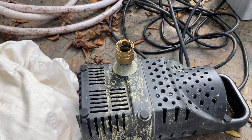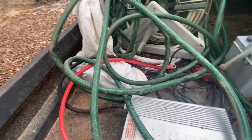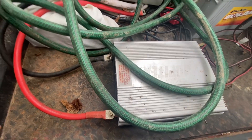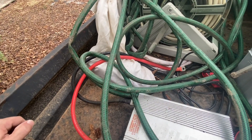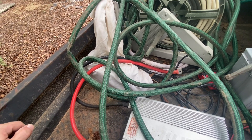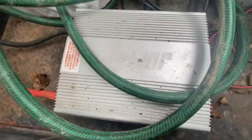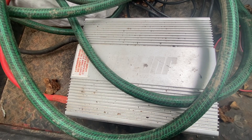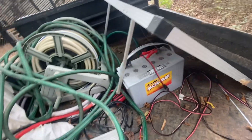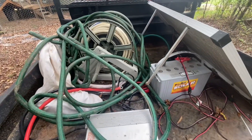I've loaded up a bunch of spare hoses and the pump in the sack, ready to go. I'm using a really big inverter because I don't know the wattage on this pump — I tried to take it apart but couldn't find wattage anywhere. If you run too high a wattage on too low an inverter you can burn the inverter up, so I'm playing it safe. This pump can't burn this inverter up, though it may drain the battery pretty fast. Luckily it's a big strong battery and I'm currently charging it with the solar panel.